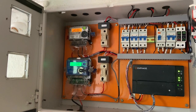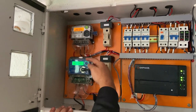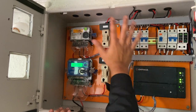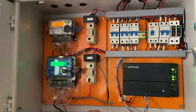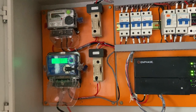This is the grid side. The power from the grid comes through the bi-directional meter and the fuse and the consumption CT into this MCB. Our solar and the grid are integrated in this panel. As I described, there are two meters — this is the generation meter, which measures the solar generation, and this is the bi-directional meter.